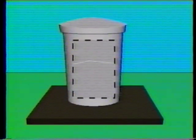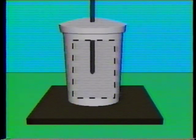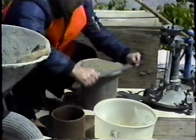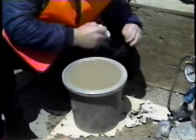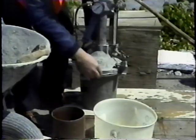The final layer is added without excessively overfilling the bowl, then vibrated the same way the first layer was. Usually the surface has been vibrated enough when it's relatively smooth and looks glazed. The surface should then be struck off by sliding the strike-off bar across the top flange or rim of the measuring bowl. Then the contact surfaces are wiped clean, and the cover assembly is clamped firmly to the bowl.